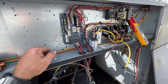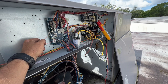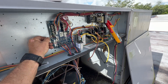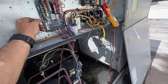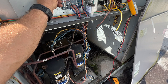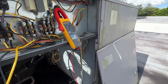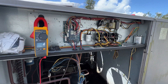I've got my 24-volt signal pulled, so every time I was energizing that before, we would blow a fuse. That motor was shorted, and that's what kept blowing the fuses. Even though it didn't show to ground and it's open, it was just a dead short in there. I'm going to button this up — at least I found the source of that. We'll get them some air back in there. I've also got to put a new belt on there and adjust that.